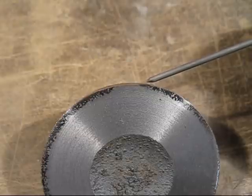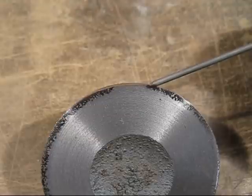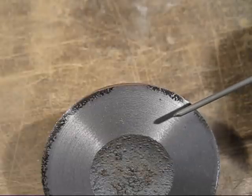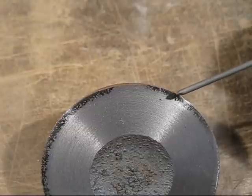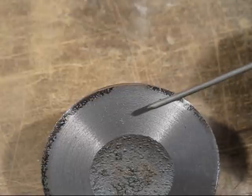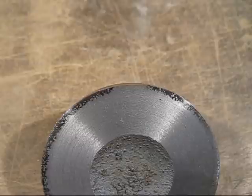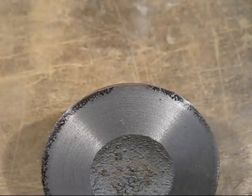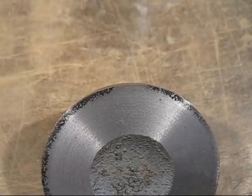So it brings an interesting question there. Can you use cast iron without ferrosilicon? Well, yes you can. If you preheat this mould, you can actually pour the cast iron in and you won't get any chill on there. So you don't need ferrosilicon. But the problem is, with this cast iron in the mould, you've got to preheat it to about, say, 400-500 degrees C, which can be a nuisance, and this is a smaller mould. But on the other hand, if you've got a really thin casting that won't fill up the mould, if you preheat it, it will actually fill up the mould with cast iron, and also it will not chill because it's going to cool very slowly.